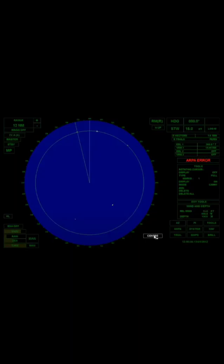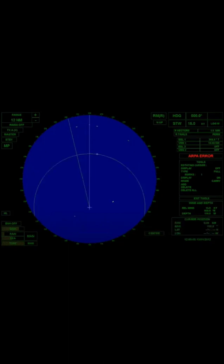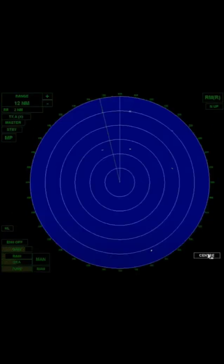Center. Center is used to put your radar display at the center and also to adjust the view of your radar or ARPA screen. Max view. Max view is used to increase or decrease the radar or ARPA view — use left click then select or drag the view of your choice and it will shift. The view can be increased and extended in the forward or north view of the radar display. Click Center again and the radar display will return to the center.